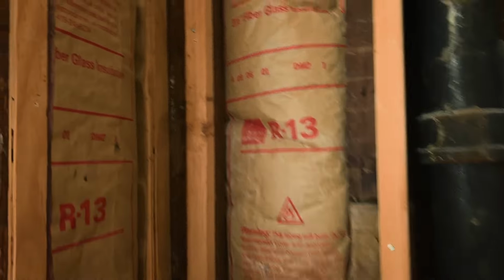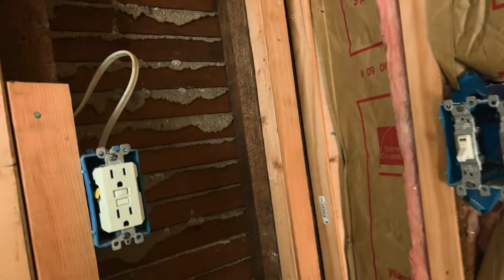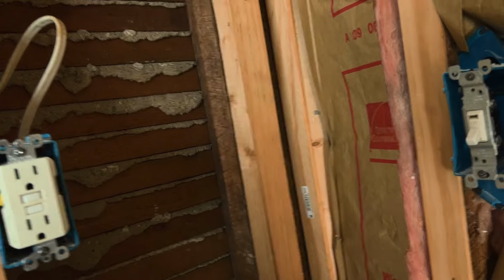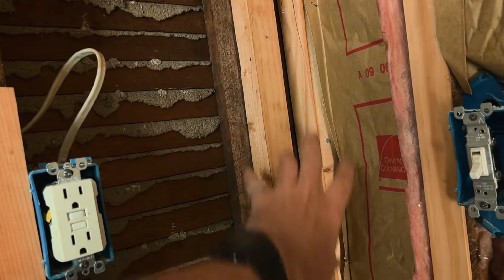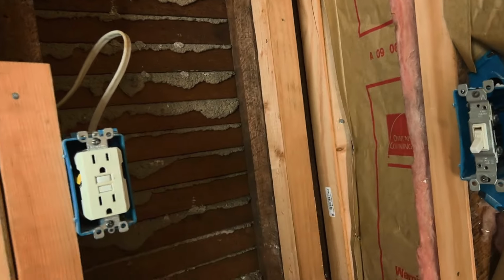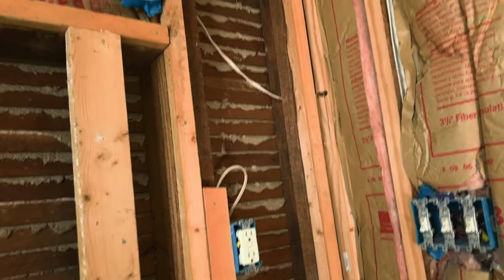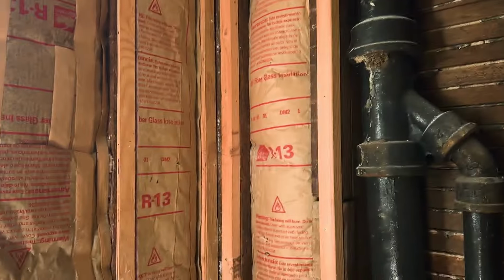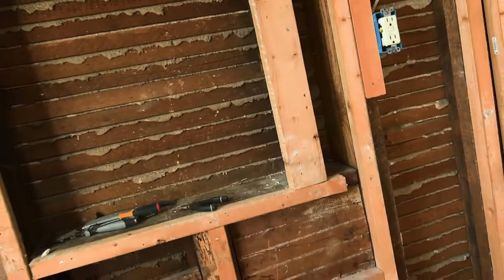Who's going to notice? Well, I noticed that these corners were really flexible and weird when I was trying to get the wallpaper off. And beneath that wallpaper were crappy drywall mud joints. I mean, they were really done poorly. And now I begin to see why. There was nothing solid there. No corners of the drywall were ever attached correctly.